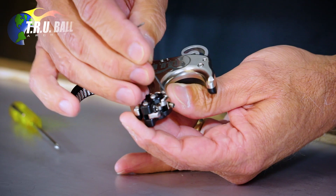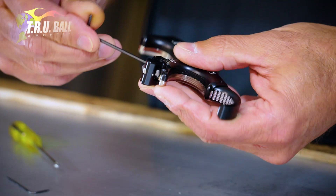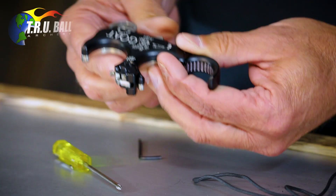There is a lock screw on this micro adjust, just like you have on the travel and the sensitivity. You really don't want to monkey with that — just make sure you've always got tension on it. As you make your adjustments either faster or slower, always remember to re-lock your sear lock, and it will be ready to go.